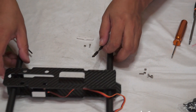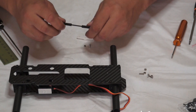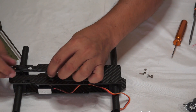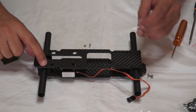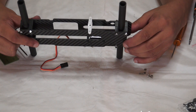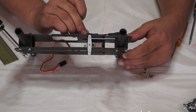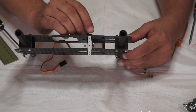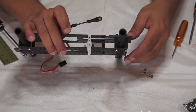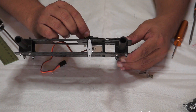Before actually installing them, we will do an eye-hand coordination and a rough estimate, and decrease the length of these connecting rods by tightening them. We need to make sure that the servo arm stays perfectly perpendicular - vertically - while we install the servo connecting rod. We need to match this length from the servo arm to the rocker arm. Make sure the rocker arm is also perpendicular.